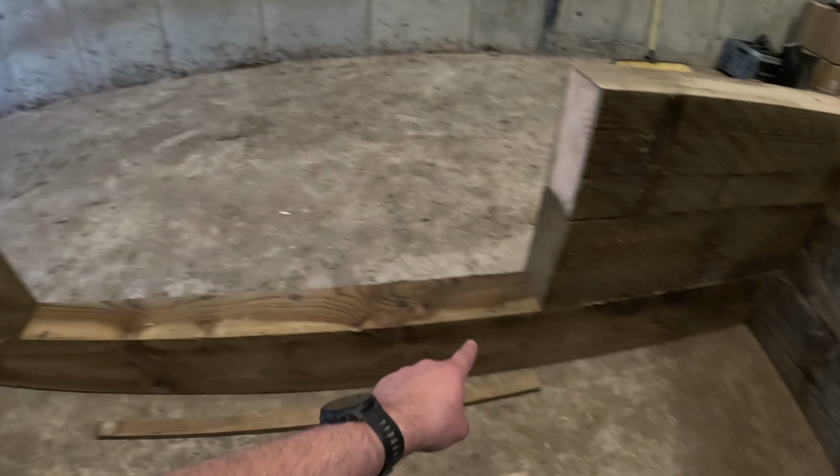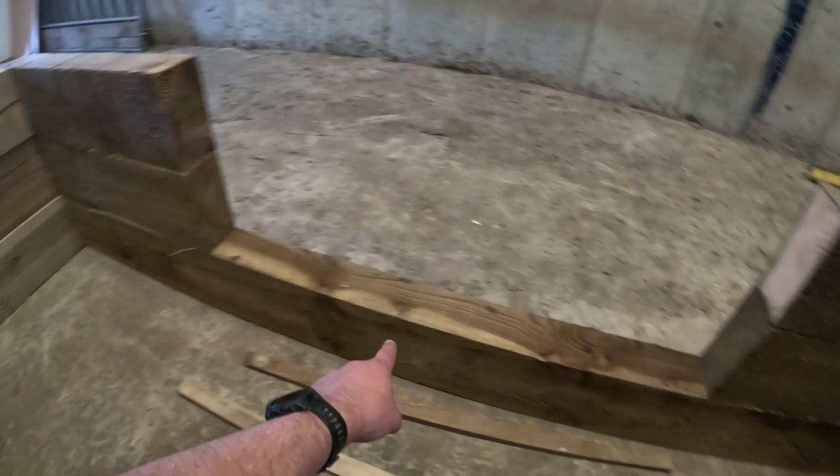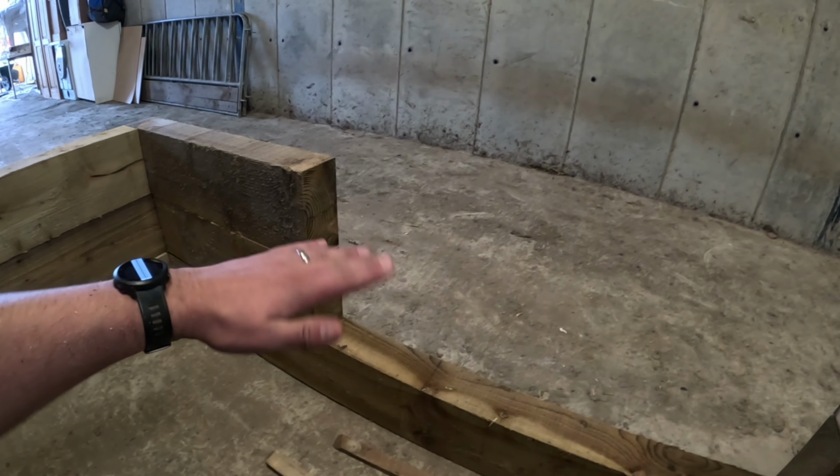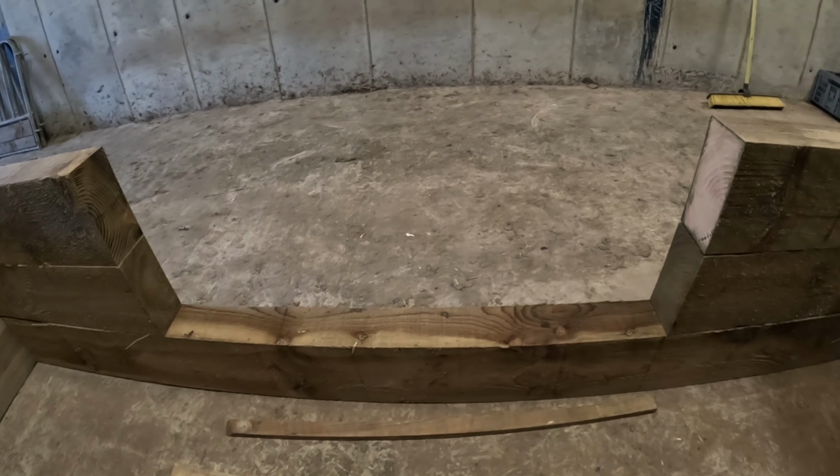Make sure you get a spirit level. So get a screw on one side, then get a spirit level, and then screw it on the other side. Because again, water has its way of finding the level. And if it is out, you'll be able to notice it quite easily. So yeah, any questions or anything, let us know.